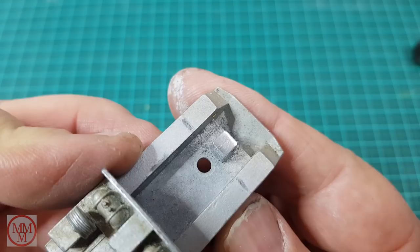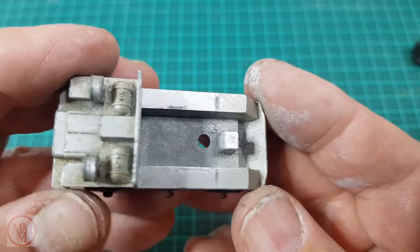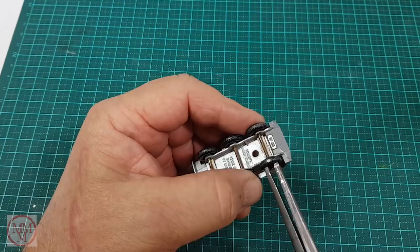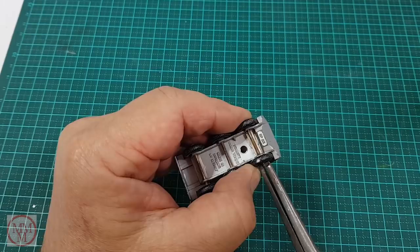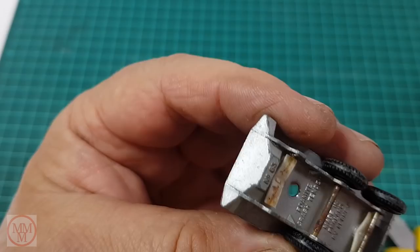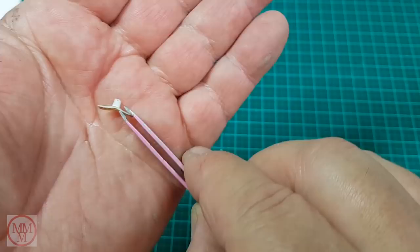This casting I thought originally was bare metal but it's not, as can be seen — I've taken the paint off there, so I'm going to have to take all this paint off to repaint the silver. Today I'm using a different method to remove the ends of axles because they're not very long and there's not a lot of material there for me to reform the end. Using these smooth long-nosed pliers I've just squashed the flange on the end and I'm able to remove the wheels.